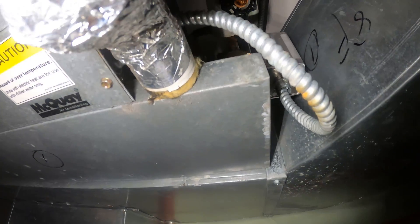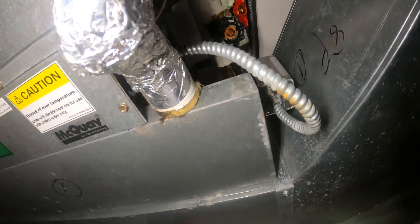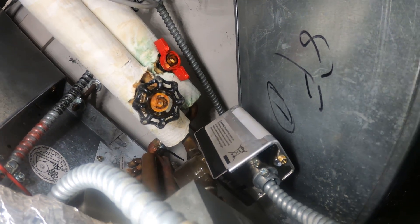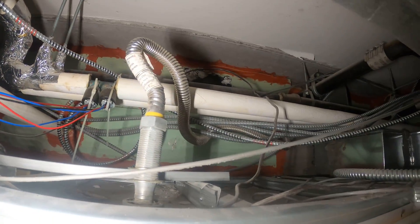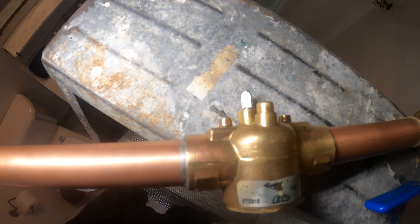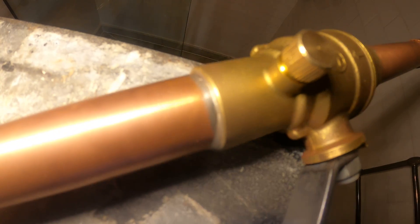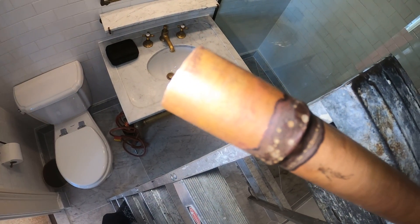The space in here is terrible and that one connection for the bottom of the header over there is just too dangerous. Our shutoff valves are right here and this is half inch. My idea was to go down the line where I have more access in this area and put the actuator here. I pre-assembled this right here — this is three-quarter copper. Here's our actuator valve body and here's a ball valve.